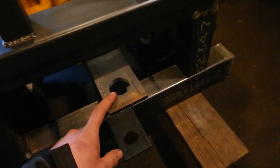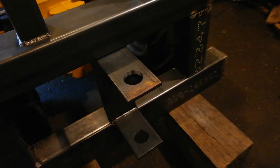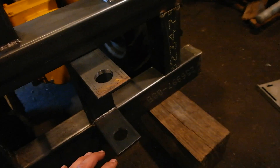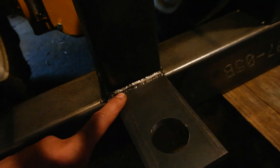This right here is a 1.5-inch hole. I'm going to be putting a 1.5-inch outer diameter, 1-inch inner diameter bushing through this, and it's going to be a big beefy 1-inch pin that connects this primary station to the slew. As you can see, for my little welder, I was able to get very good welds on this 3-inch steel, so I'm very happy about that.